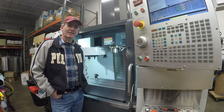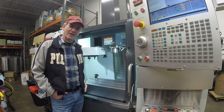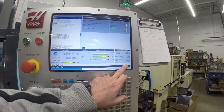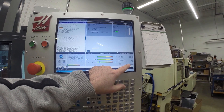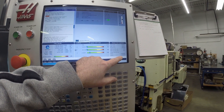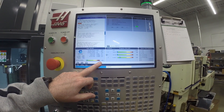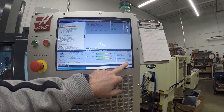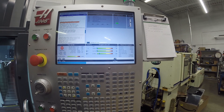So right now I'm running at the last step speed, running at 15,000 RPM on my spindle. Let me show you the screen here. Right down in here you can see how many seconds are remaining in the first variable. The second variable is showing the current load on the spindle — it's capturing the load and showing the value that's getting compared. So if this number goes above a threshold, the machine stops.